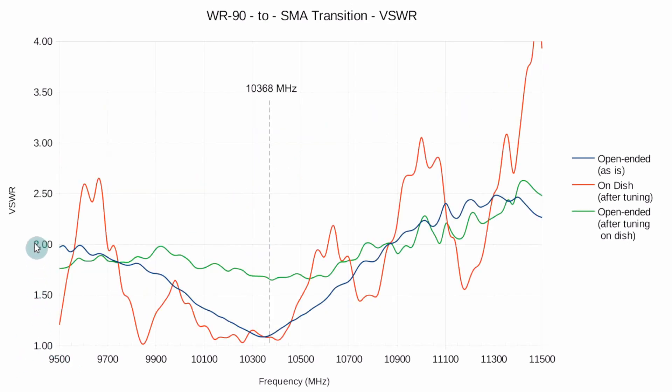This is the same data plotted on a VSWR vertical scale — standing wave ratio, which is more familiar to many. At our frequency of interest, the red line is in the 1.1 to 1 VSWR range for a big chunk of the span. Each vertical line is 50 MHz, so it's a pretty wide range of operation — more than 100 MHz. Very happy camper here. See you soon. 73.